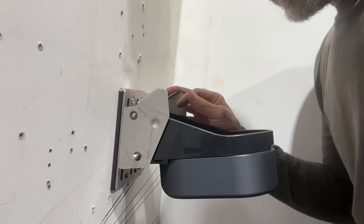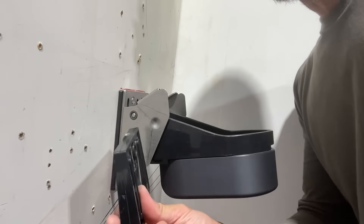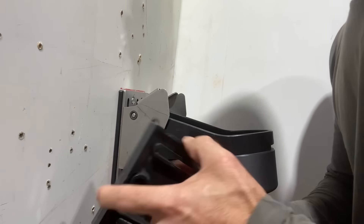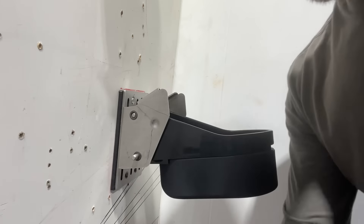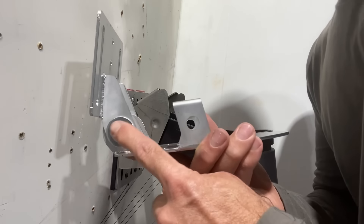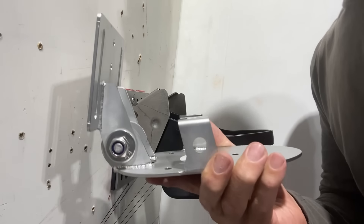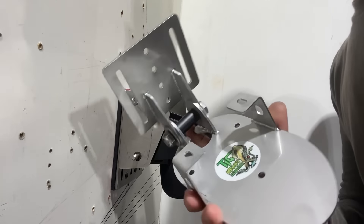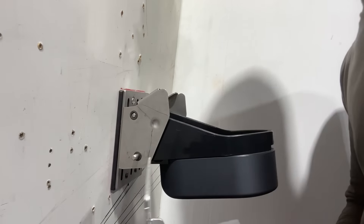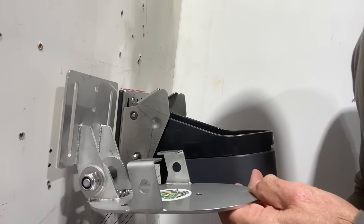Obviously this is harder with wedges — you've got to take the wedges out. If you don't know what angle is needed, you put one wedge in, check it, turn it around, check it again — oh, it needs to go down more — more configuration. So it's a bit of a hassle dealing with these wedges. That's why we created the TM2 mount. You've got one fixed bolt here which gives you the angle you need — very easy to adjust the angle on these compared to wedges. The jack plate also suits our TM2 mount as well.